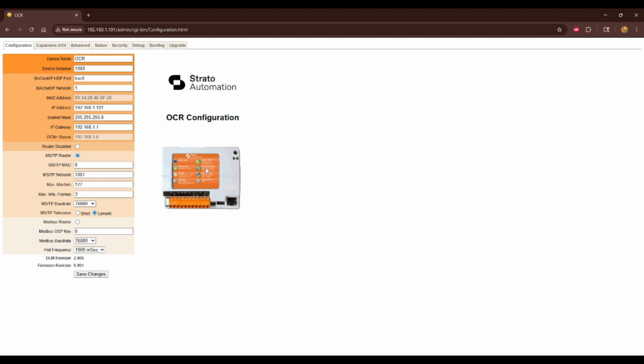So you'll want to grab the IP information from that and make a note of that, because to first connect to our router, we'll have to match the network settings of the router, and then we can connect to it and change it from there to be on whatever network we like. But to start off, we'll need to grab that IP information.